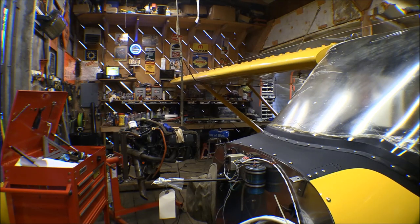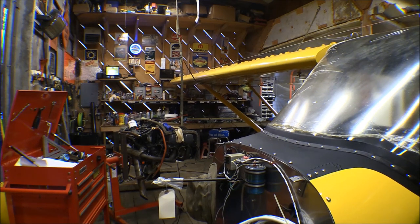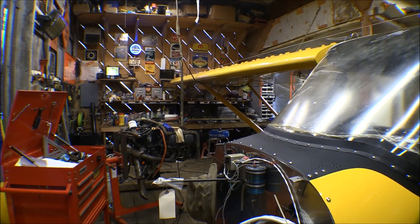That's a pretty important safety aspect. You might think it would increase your takeoff run, and it probably would, but there's not a whole lot of twist in the wing, so it might affect it some. You might be more efficient if the wing was flat, or if the trailing edge was down a little bit for more angle of incidence at takeoff, but your stall and slow-speed characteristics would diminish.